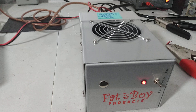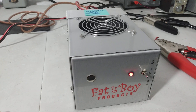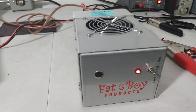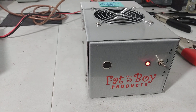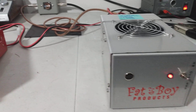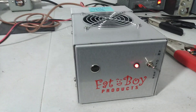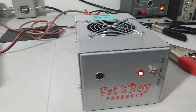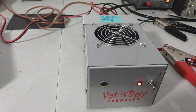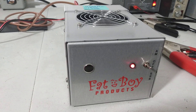Two-pill 2879C — hit this thing with a Striker 955, 655, or 447 and you'll really see it come alive. We're only hitting it with about half power here, about 80 to 100 watts PEP going in. You'll see this thing jump up and probably see 600 plus out of it. That's it guys — two-pill 2879C with bias and delay for sideband.